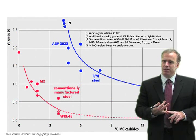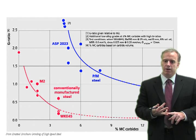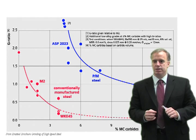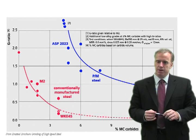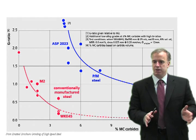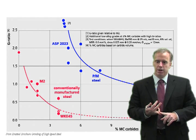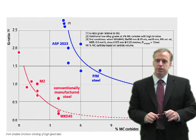Is powder steel easier to grind than conventional? Well yes, in general, for a given alloy content, it's always easier to grind. But one of the benefits of powder steel is you can switch to grades that have a huge amount of tungsten, molybdenum, and vanadium carbides. If you produced that same grade in conventional steel, it would be brittle, very difficult to grind — just a disaster. But they're able to produce that steel in powder grades and they're grindable, reasonably tough, and extremely highly alloyed, so you get a better grade.